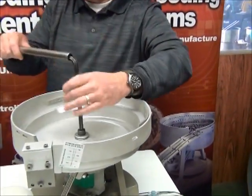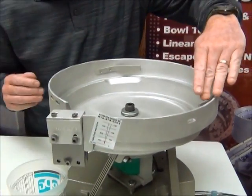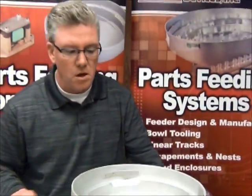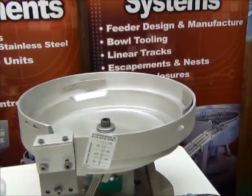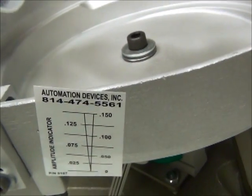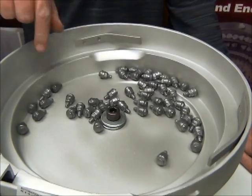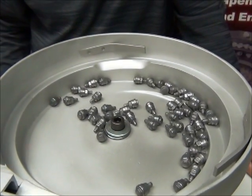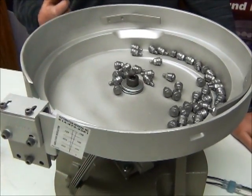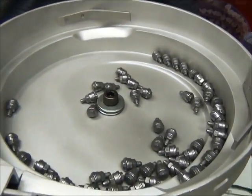The difference between this bowl and the one that was just on here is it has a tooling block on the end, a wiper over here, and a wiper over here. That's going to add a significant amount of weight to this bowl. We're going to turn it on and you're going to see what happens when I put the parts in. You can see they're barely vibrating — they are starting to go around but this is about as fast as you're ever going to get. This is an example where added weight has taken away the performance you need.